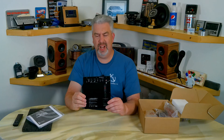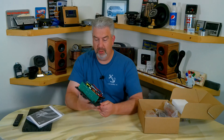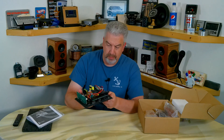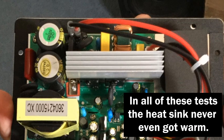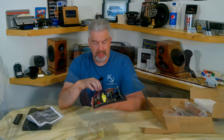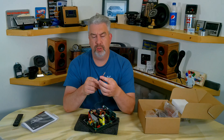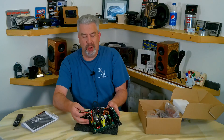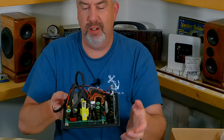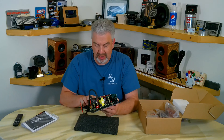It's pretty small — about the size, maybe a little bit smaller, of the 70-watt unit that Dayton sells. It's not much bigger than the 25-watt unit they sell. This here is the heat sink — that's what's really wicking away the heat. It looks to be about an eighth of an inch plate. It's got a couple of quick-disconnect terminals, fairly thick wire, wrapped in foam so it won't rattle around.